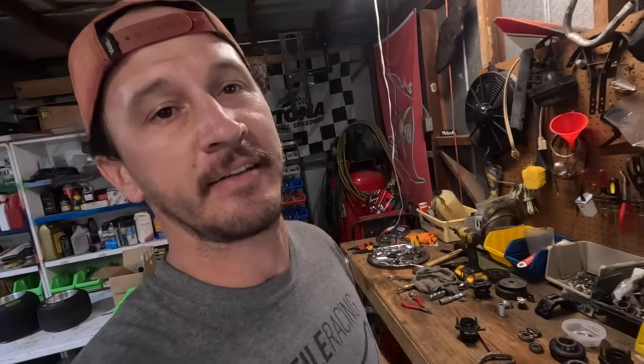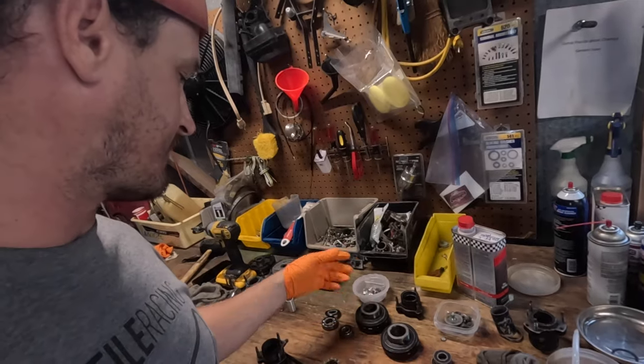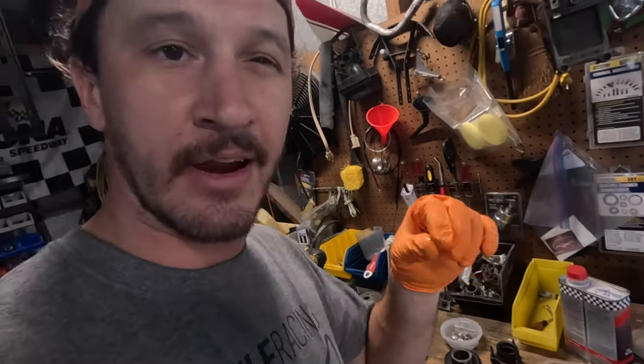That was a time-lapse — some of that was me babbling while pretending to time-lapse, but regardless, got all the bearings cleaned up. Used mineral spirits, soaked them for about five minutes, and freely spun everything in my hand. You want to listen — you can actually hear sand or any kind of grit in there. Roll them and spray them until you no longer hear that grit.